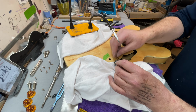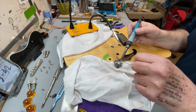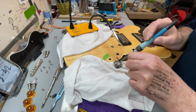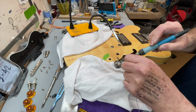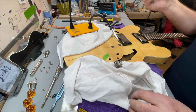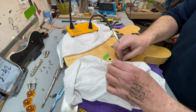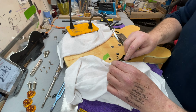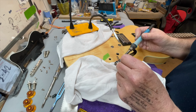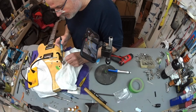Well, I can get a load of solder onto the core, onto the sheathing, I should say. Thankfully, I've got quite an odd iron. It's really struggling to heat this braid up. Oh, I hate this. I hate this. There's a plastic wire too close to it for my liking. Maybe that's where I'm going to have to go on this point here. But chances are it's eventually going to melt the ground lug.